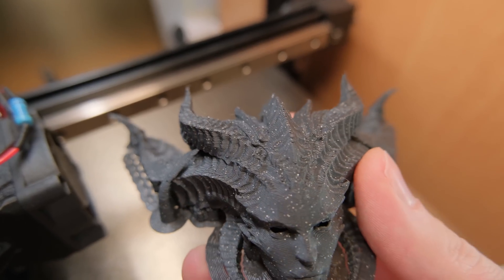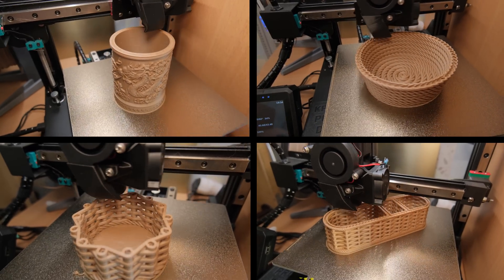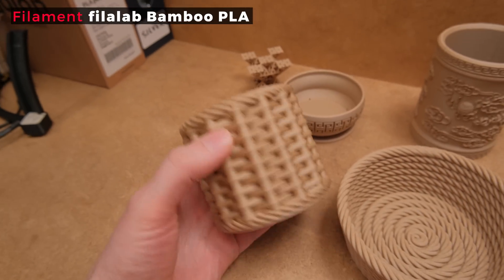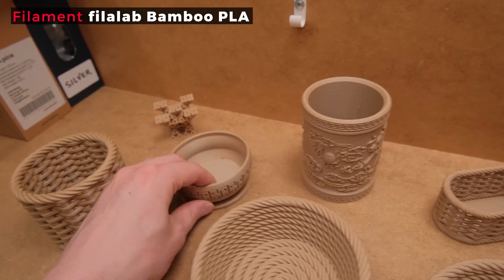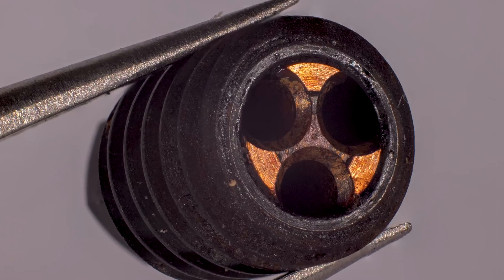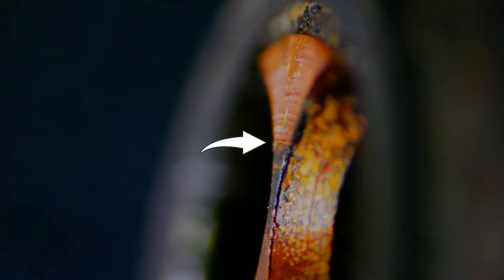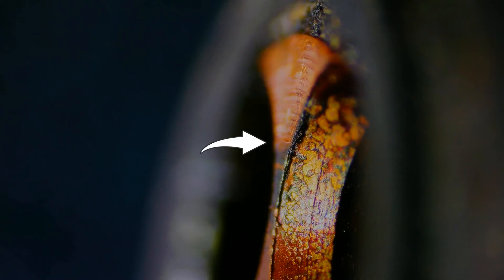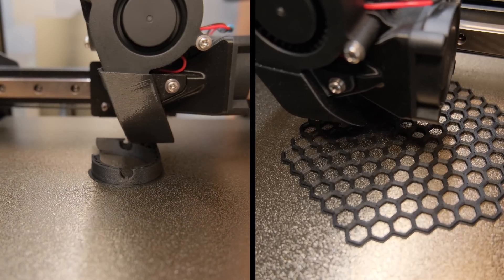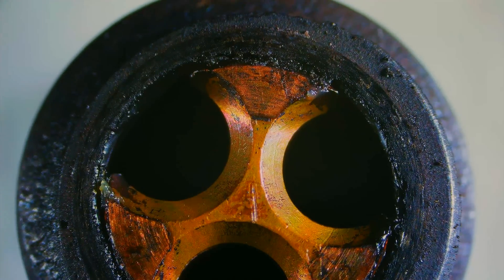However, we all know that copper is a pretty soft metal, so how will it hold up after printing abrasive materials? To test that, I printed one thing after another and ended up using around half a kilo of filament with wood fibers. What was impressive was that I had only one clog with a 0.4 nozzle and that the wear was almost insignificant. It didn't look that way when I first took a macro photo without cleaning the surface, but after cleaning all the gunk there was a very clear and tiny ridge on the copper insert — only visible under a microscope. I also made a few prints with carbon-filled nylon filament and after cleaning the nozzle it didn't seem to make any noticeable difference compared to before.